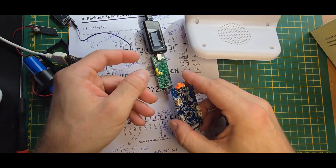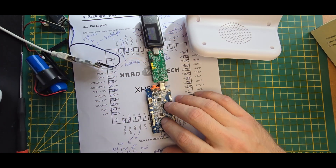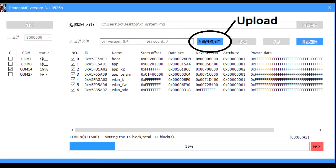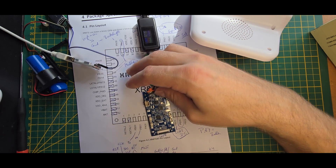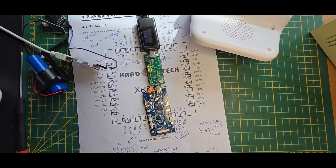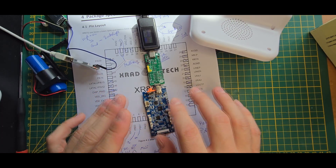After that we can run DOOM on it. I'll show it now — basically just plugging it in, having the UART connection here, opening the DOOM port on the PC, and starting the flash. Now turning it off, bridging the pins and turning it on again — the upload has started and I can see it running. It takes around three minutes. The flashing is now at around 60%, so let's talk a bit about the DOOM port and how the programming worked.